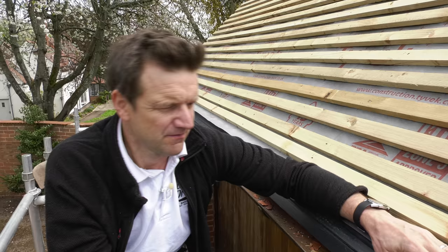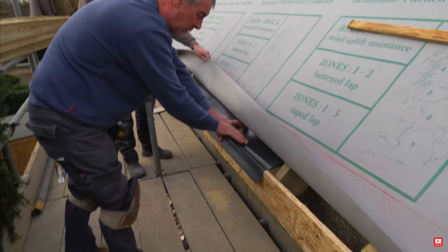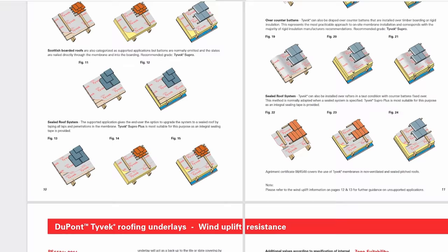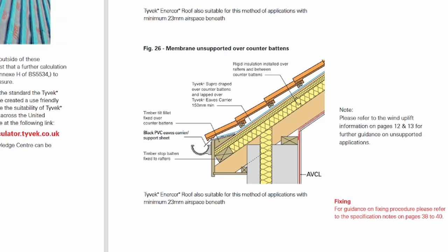I'm still having problems with the eave support tray. I watched a skill builder video where roofers said that with plain Rosemary-style tiles, eave support trays are very difficult to use because the support tray gets kicked up. They use 150mm wide damp proof course instead. But I really like eave support trays — lots of you said this week that the benefit is they don't get kicked up by the wind and it's just a superior solution where the eave goes into the gutter. My Discord chat forum sent me a brilliant visual from Tyvek explaining how to insert timber tilt fillets to stop it kicking up, but I have a problem with this on my design of roof.